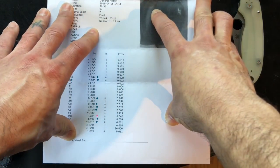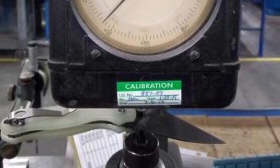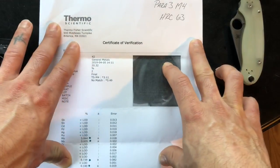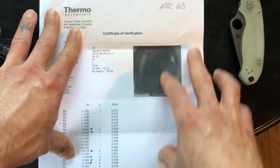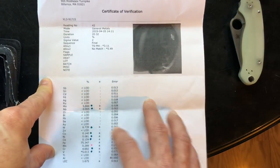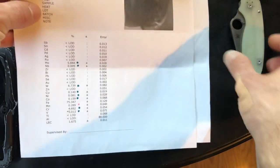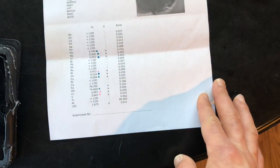As far as the HRC number on the Para 3 M4 — that's a really nice number. You're looking at 63 HRC. That's really good to see — pretty much where it wants to be. M4 can go all the way from 58 to 65: at 65 it's more about edge retention and edge stability, whereas down in the 58 range it has a little more ductility and toughness for impact. But at 63, it's going to be performing excellently in every facet. That's really cool to see — I'll move along into the Benchmade Super Freak.